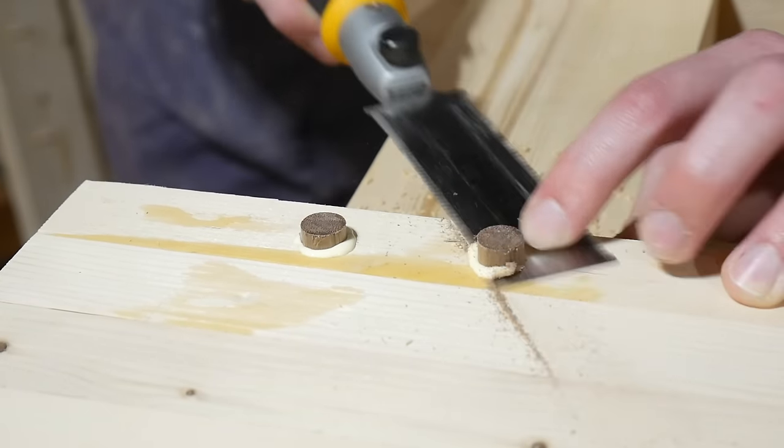I'm not going to be putting a finish on these legs, so I wasn't super concerned with the exact looks. Here you can see some of these huge 60-inch Bessey parallel clamps, whatever you call these clamps. I was seriously impressed with the amount of clamping pressure. I needed a ton of clamping pressure to pull those tenons all the way into the mortises, because once the glue got in there, they really swelled up. I just did that by going back and forth, wrenching down on the clamps. I was really impressed with that, and they worked out great for this.